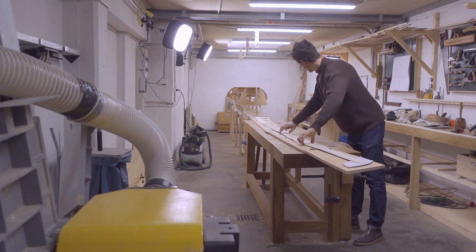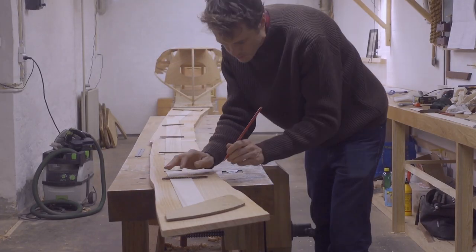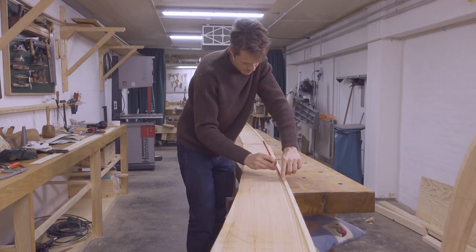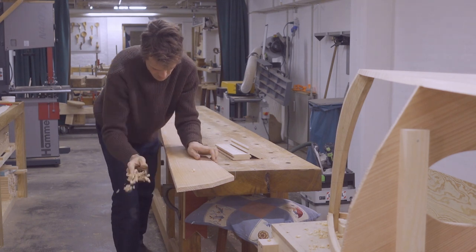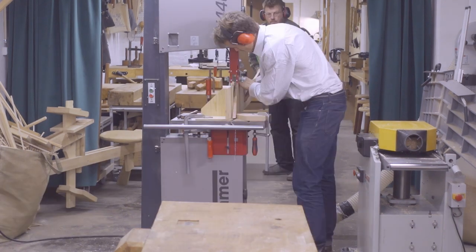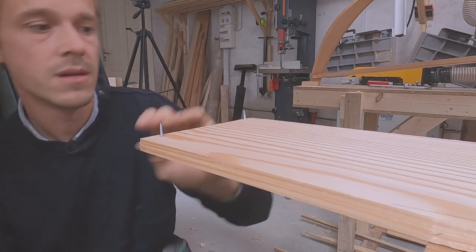Now the plank pattern is done and I can take it off. I'm placing it on my planking stock and I try to make it follow the grain of the wood the best I can. I'm making pencil marks at the edges of the cardboard patterns, then drawing a line through all the points using a flexible batten. I'm cutting close to the line and then doing the last bit of shaping with a block plane. Now I just need to split the board in two to get my pair of identical planks. This is an easy method because I have a big bandsaw set up for heavy rip cutting. If you don't have this kind of setup, simply using two thinner pieces of wood for the plank pair will work just as well.